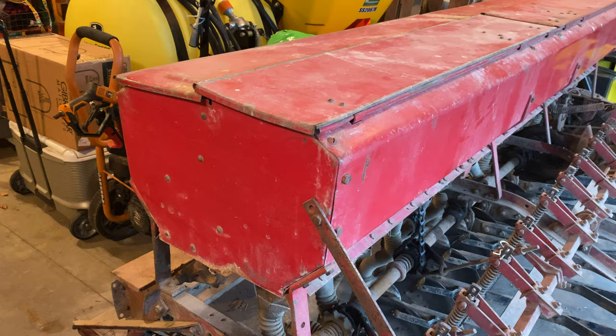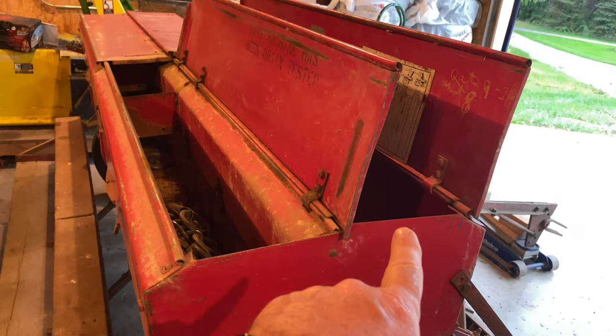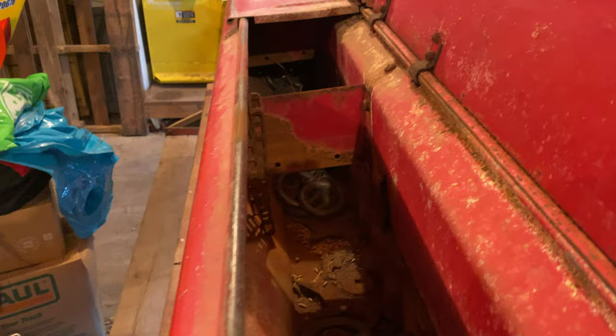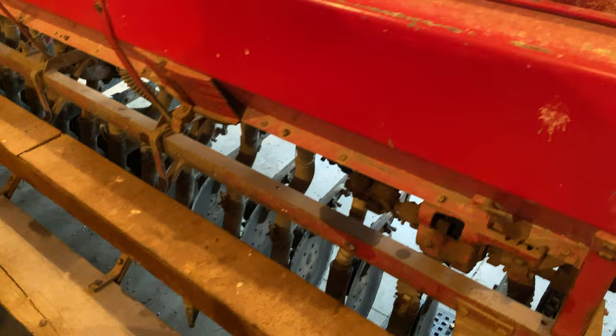Let's start at the top and work our way down. This part up here is called the box — the seed box. There are one, two, or three different boxes that will come with this. Number one is the seed box, with settings you adjust depending on the amount, size, and seeding rate per acre. A second box is a fertilizer box — they used to plant seed and fertilizer together. Ninety-nine percent of the drills you go look at, the fertilizer box is going to be rotted out, sometimes just shredded with no metal left. A third box you might have is a grass box.